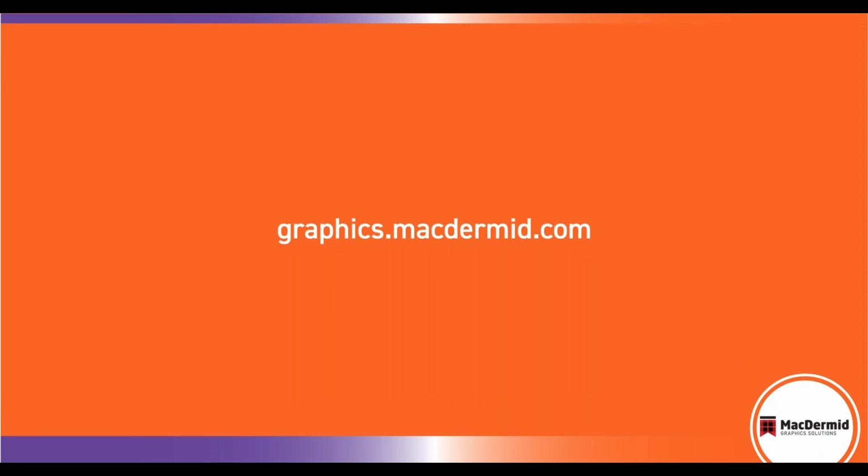One of the questions relates to anilox rolls. Are there any recommendations for anilox rolls to help improve the print and get the best LPI? With the newer presses that are coming out and some of the new advancements in flat top dot technology, anilox rolls have been getting much finer and finer. We're seeing some incredibly high anilox roll counts in some of the post-print applications that we have tested on, and still trying to gain significant information with regards to the different versions of anilox out there to see if there is one that would give us utmost optimum performance. But right now we don't have that data.